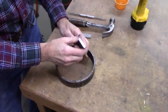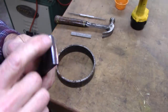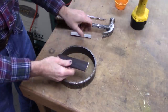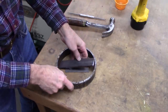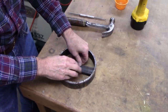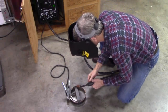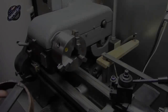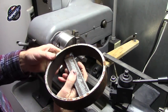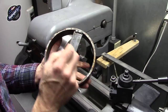Okay, I got a snug fit here. I've ground a taper on the ends because I've got a 110 MIG welder, and I want good penetration on that. Using that as a spacer. Okay, I've got the ring welded up with one spoke in there, and I'm going to drill a hole in there and true up